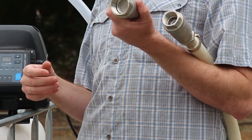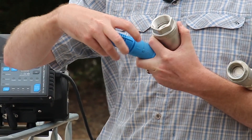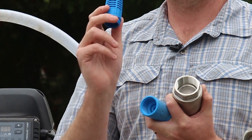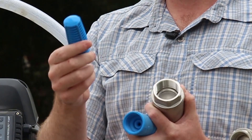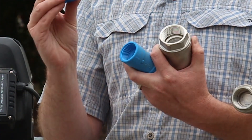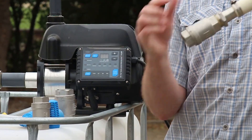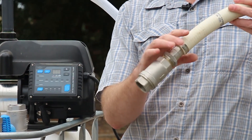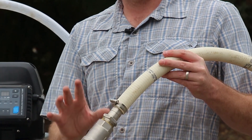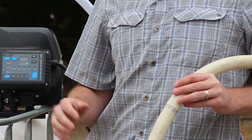We have two examples here — an inch and a quarter check valve and a foot valve. The main difference between a foot and a check valve is the addition of the strainer. If you're pumping clean water, you don't need a strainer. If you're pumping water from dirtier water sources like a pond, you definitely want a foot valve because it includes the strainer. These are one-way valves that allow water to come into the hose, and when we're no longer pumping, it keeps the water from flowing out and maintains our prime. If you don't have a foot valve, air can enter the system and water can flow out — we'll lose our prime and have to start all over again.